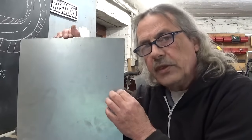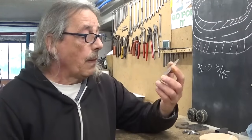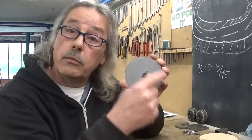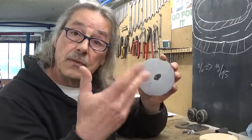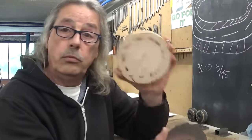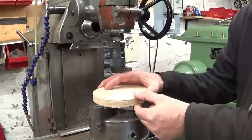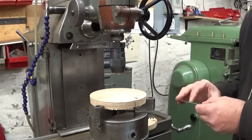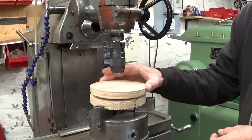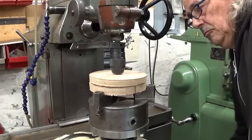So I will make them out of sheet metal steel, which is 0.8 millimeter. As you can see I already started a little bit — I cut out a more or less circular blank which is too big, because I'll make it to the final dimensions later. My idea was to glue this thing with wood glue onto a piece of wood, so I installed it in the milling machine, found center, put glue on it, and then pressed it together with another piece of wood to hold it nice and flat.